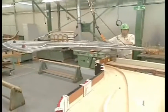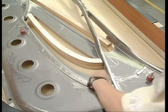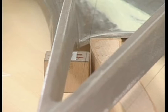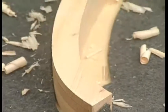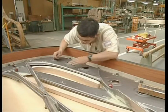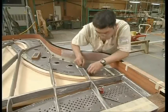The uncoated frames are delivered and carefully matched with the main body of the piano. Bridge height adjustment is just as important as frame matching. Craftsmen tighten thread instead of the actual strings to carefully determine the height of the bridge, then shave the surface of the bridge with utmost care until the indexed height is obtained. If the bridge is too high, sustain is lost; if it is too low, the sound generated will not resonate as desired. The optimal bridge height obtained over many years of experience is applied to the entire sound range.